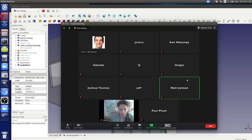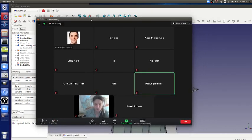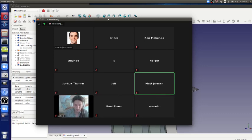Sure. Should we have all the panels in the completed house assembly? All the second story platform and roof panels? We want to. They are providing structure. Yeah, we should have them in there because that determines which ones you cut. Some of them we cut to 6 feet, some of them we cut to 4 feet because they're staggered. A lot of them are going to be 8 feet, but the ones on the ends, when you stagger them, you have to make the ones at the end 4 feet. So one row will be complete eights, the other one will be 4, 8, 8, 8, 4, and so forth. So we need to know that pattern.